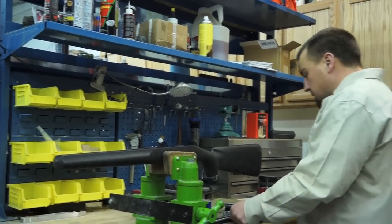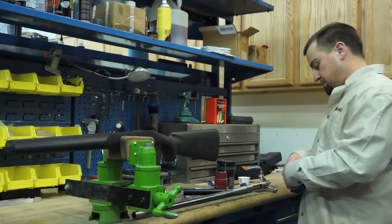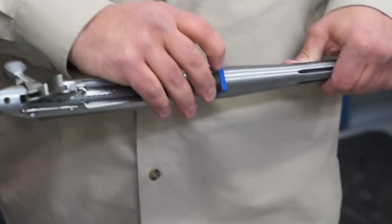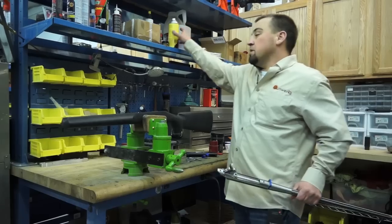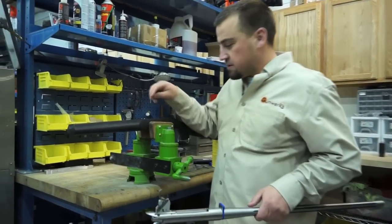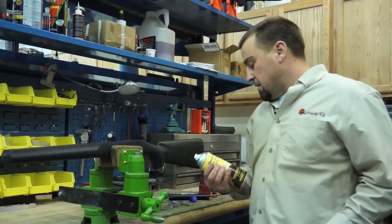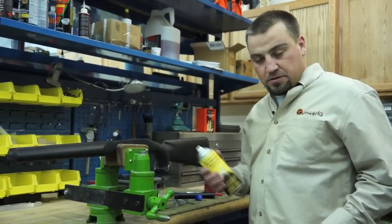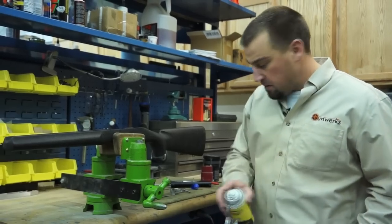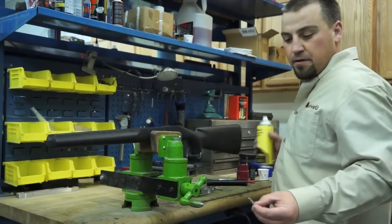We'll do a little prep on our barreled action first — we're going to tape off the recoil lug. I've got the sides of my recoil lug taped off and the bottom taped off. We're going to leave the front and the back exposed. We're using epoxy, so we don't want the glue to stick to our recoil lug — just to stick into the block itself so we can get this out if we need to. You can use AccuRelease, some kind of release agent to make it so this doesn't stick. Give a good spray on there, and also put a little on that front action screw.